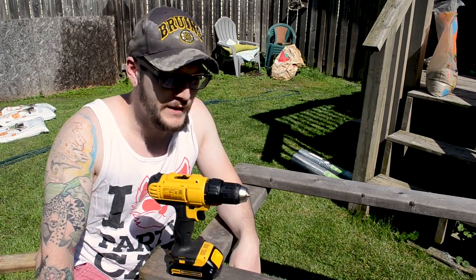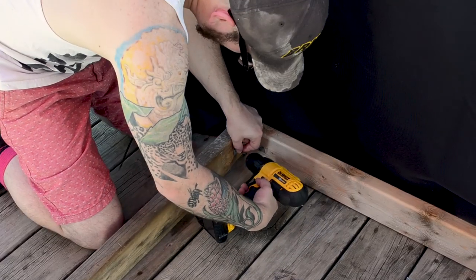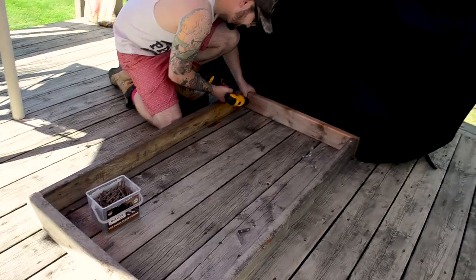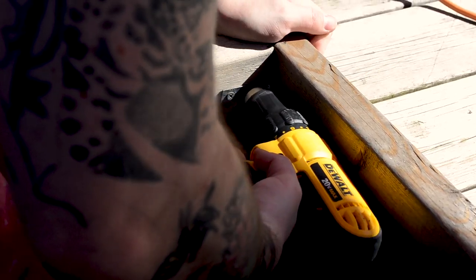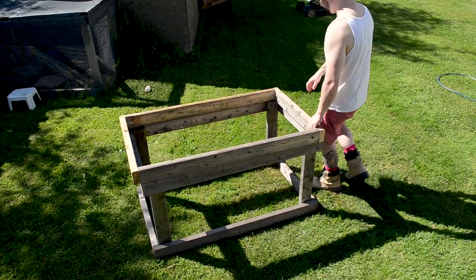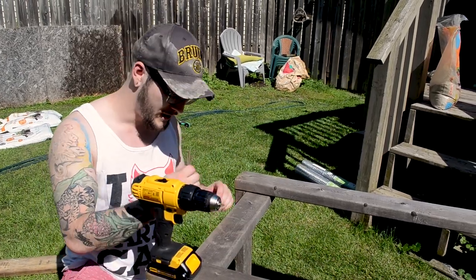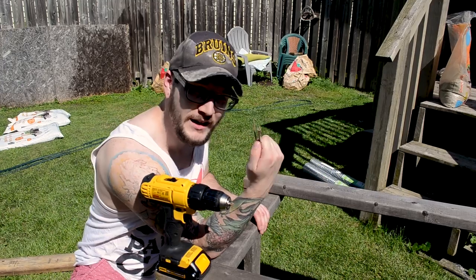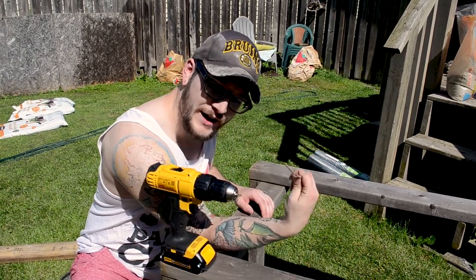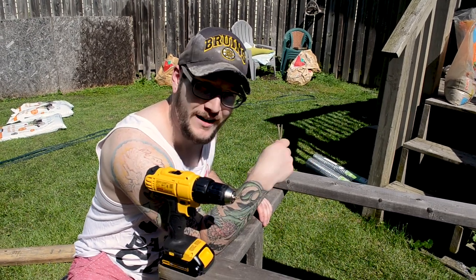The easiest way in my opinion is to make the top and bottom frame first, and then put the 2x4s that are actually holding it up in after. Make one frame — imagine a small door frame is what you're making. Then you screw the side pieces onto one end, have your other frame made, rest one on top of the other, and put the screws in. I'm just using 2.5-inch deck screws and a regular drill.